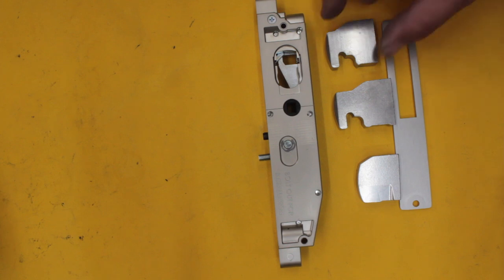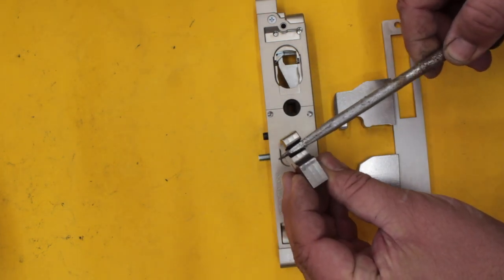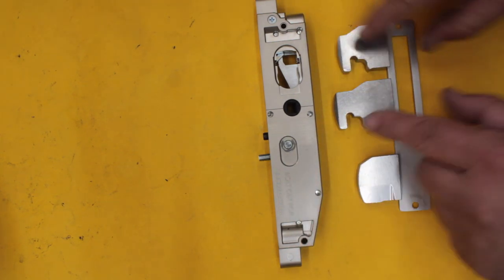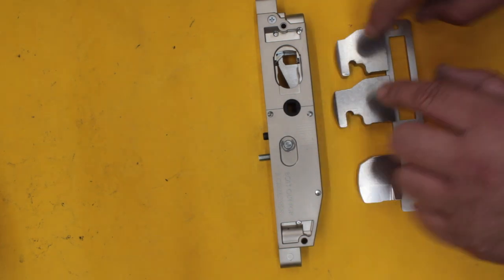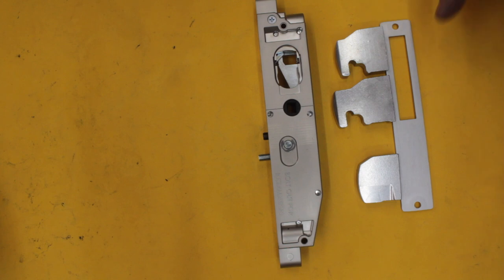So you've got a long and a short hook bolt. When the door actually closes, it goes into a latch keeper on the other side. There are two sizes, and it looks like you can use two sizes for that latch type. That's mainly used for aluminium sliding doors that come together. That's good because it's giving us an extra size. Not only that, you can use the long bolt as a long bolt even though it's got the cutout — it's still going to be the same as a long bolt.